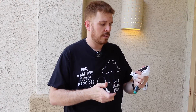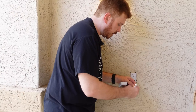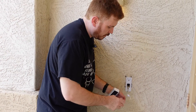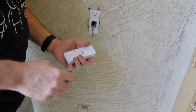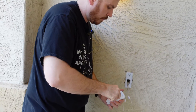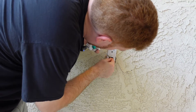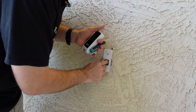Since I'm just using the standard doorbell wiring in my house and the app on my phone, I will just install with these. It's a smart doorbell where I can just put any wire into these here — you just pinch and push it in. I'll straighten this one out, put it in the little hole, pinch it, push it inside the hole, and release. Now I'm going to loosen these screws, slide that in, and we've got some power.